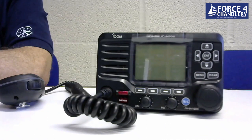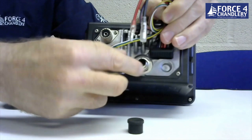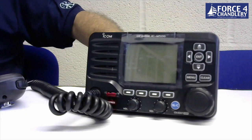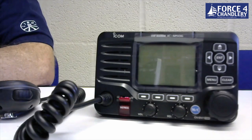The M506GE has both NMEA 0183 and NMEA 2000 connectivity, and any data on the NMEA 0183 bus can be converted inside the unit to NMEA 2000. Other functions include last call voice recording, which automatically saves the last two minutes of the last incoming call — you can replay the received call so you never miss any incoming calls. It also features bi-directional active noise cancelling which provides superb performance.